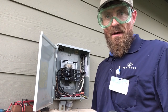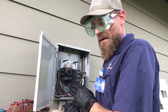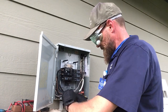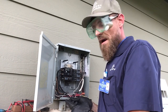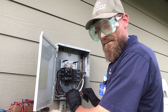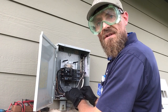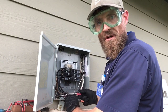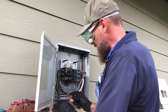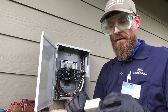I've loosened everything up for video purposes today. We will undo the screw — this one is wired directly to the breaker. We have removed our line, which is supply power. We will disconnect our load, which is the red wire going to your lights, and then we will also disconnect the neutral wire which completes the circuit.